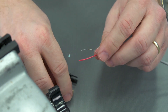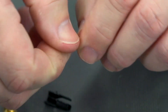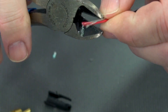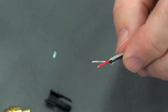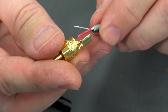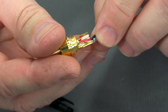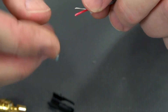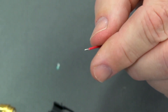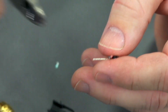So I have my drain wire and my conductor. I know the drain wire is going to land down in the bottom, so I can begin trimming things to about that length, keeping my finger over the other side of the cutter so I don't have pieces flying unexpectedly. The shield is going to go down below. As I put the conductor in the cup, I find I'm going to be taking about that much jacket off. Let's go ahead and take that off, and I can trim the drain wire up a little bit too.